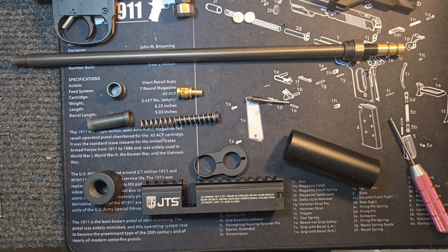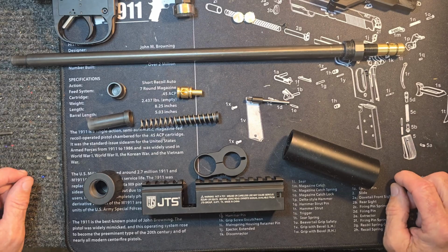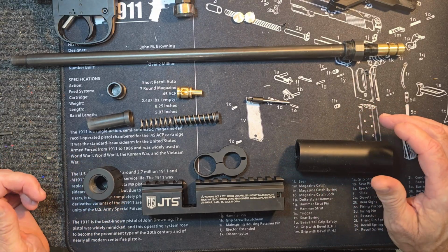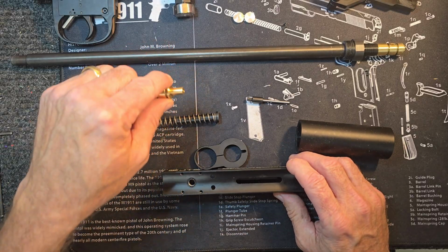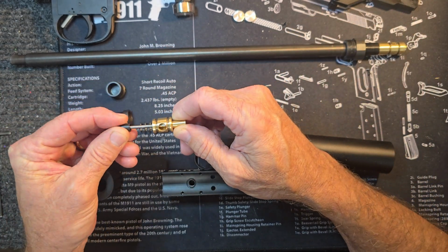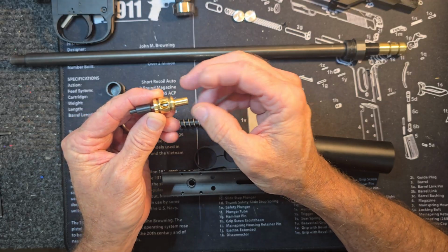Howdy, y'all. All right, so we got the 30 cal Airacuda taken apart. And what we went and done was determined we could open up our transfer port, which starts here. This is where the poppet valve is. The hammer hits over here and opens it up.